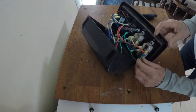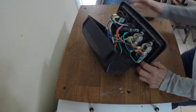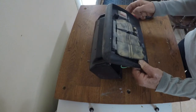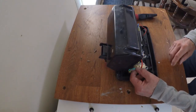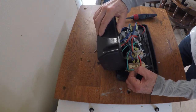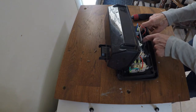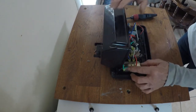So if we put a switch right here — just cut this wire out and run it maybe to the front somewhere. There's some space over here. At the back, near the circuit breaker, it fits right here — that's a good spot for a switch. So what we'll do is cut this wire, run two wires over here to a switch, and turn it on and off for house use and generator use, so you can use it for both.